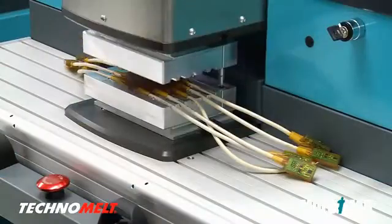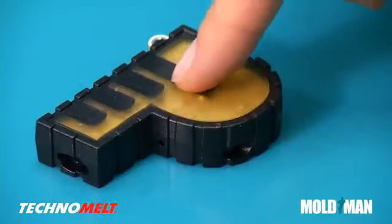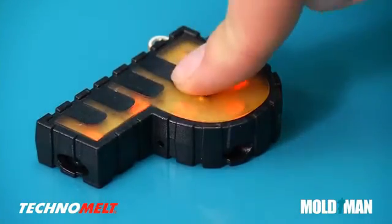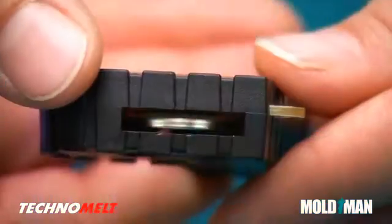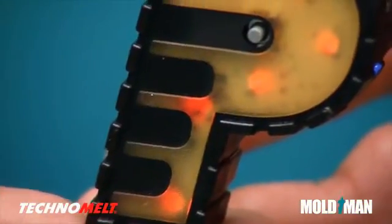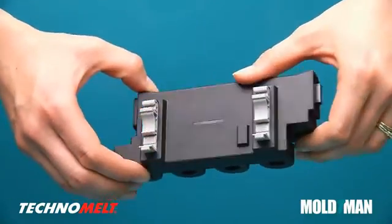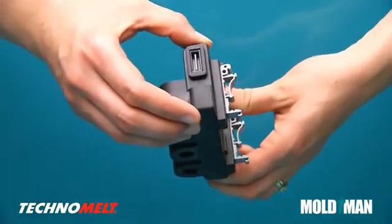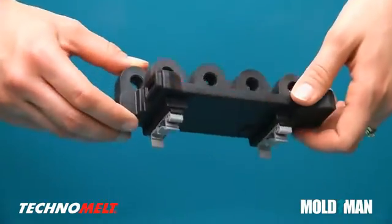This unique product has been molded to protect electronics from saltwater immersion. This product uses two-tone molding to showcase LEDs and takes full advantage of MoldMan any-shape design to reinforce branding by molding electronics in the shape of the company logo. This product was two-tone molded with transparent amber and solid black Technomelt to form integrated light pipes and a functional all-in-one housing.